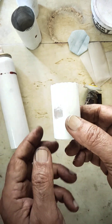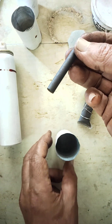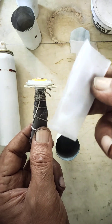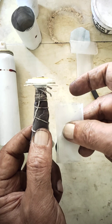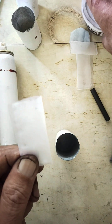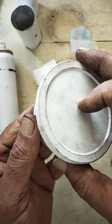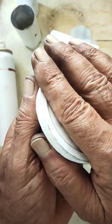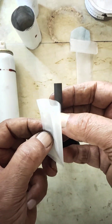This is the aluminum can — cut from used spray cans which you can get from your house. The other part is the carbon electrode, which should come in the center. With this carbon electrode I will tie a nylon bag which I have prepared by sealing the corners. This bag will be filled with graphite, carbon black, and manganese oxide powder.